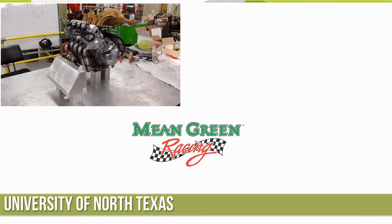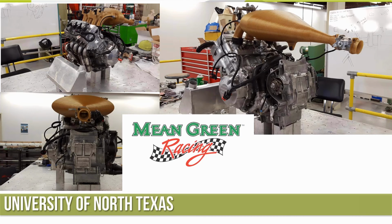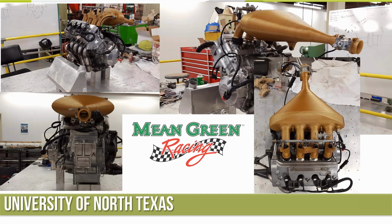So these parts were actually for the University of North Texas Formula SAE race car team. Some pictures here of those parts actually mounted to the engine. They're going to be doing some dyno testing here in the next couple of weeks. So this is an engine off a CBR 600 F4i, so everything's stock right now. They designed and built the intake and exhaust. They ran some SolidWorks flow analysis on it and saw a 12.5% flow increase over the stock unit. They'll see how the dyno testing goes coming up.